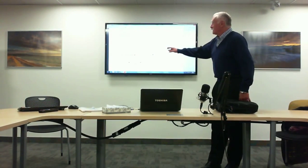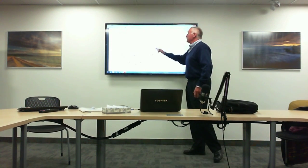So again, the last word about the autodyne. It's a tunable oscillator, which, because it's an active component, is automatically a mixer as well. And a mixer would create sum and difference signals. Remember this, two signals are beaten together. Later on, for single sideband, we outright call a module the beat oscillator. The word is action, beat, a signal multiply. So signals in radio frequency mixers are multiplied, they are beaten together as you beat eggs. So when you multiply two signals, it is very important, and I wish you remember it, you maybe remember it from Tuesday: multiplication in the time domain is the same as addition and subtraction in the frequency domain.